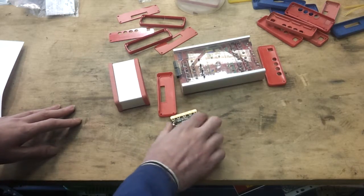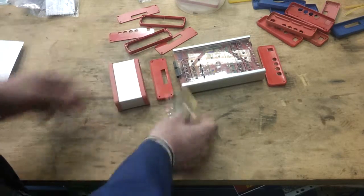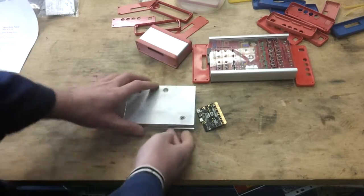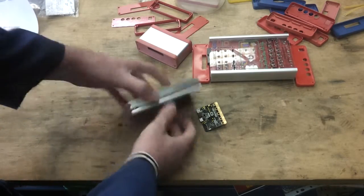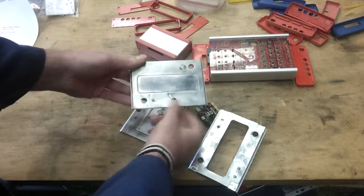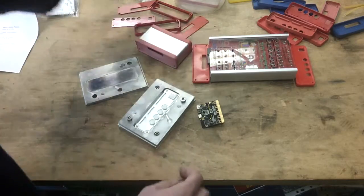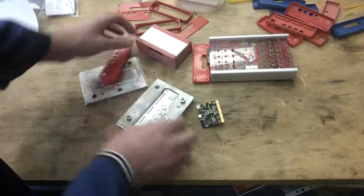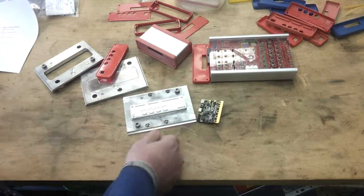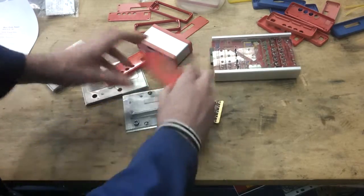So what I've got to do is modify the mold that made these to make a slightly larger slot to take the header socket for the BBC micro:bit. This is the mold that I put together last year — it's a three-part system. There's basically the front plate with a feed point, then there's a skirt which goes around it to form the housing, and then the central section is actually interchangeable. There's a couple of screws on the back — that's the one for the motor side and that's the replaceable insert for the header side.